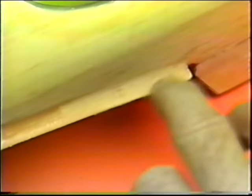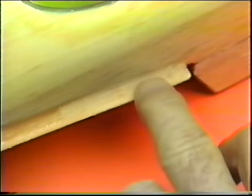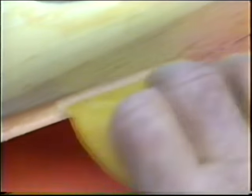Now, better. I'm trying to get this on a close-up. You can see the little shiny spots. When you know you have little shiny spots, you know you still need to do a little sanding. You'd like the whole area to be dull. Then you know, if you're using a polywog or a sanding block of some kind, it should be relatively smooth.